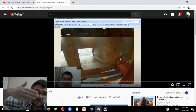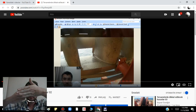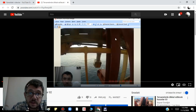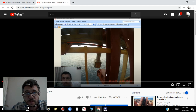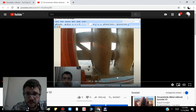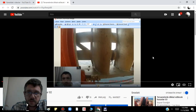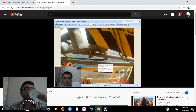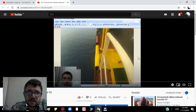You see here — this is somehow damaged. This is the supporting piece of the ladder. When you take the ladder in parking position, it is supporting from down to keep the ladder properly. But you see this is not supporting, so the ladder deflected. You see — this is already deflected. The ladder deflected because of no support here. You cannot make all of them on the vessel because it needs aluminium welding — so it is actually a shipyard job.